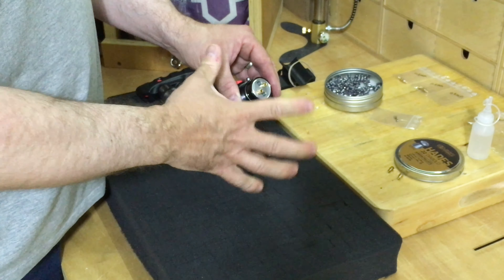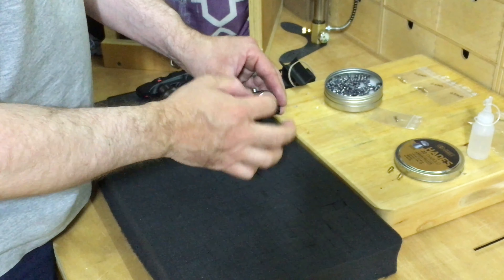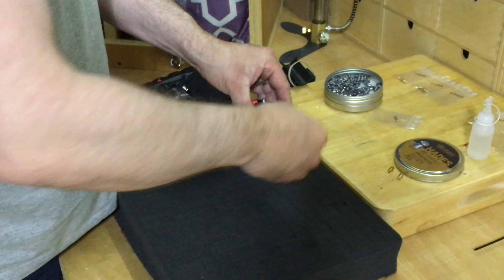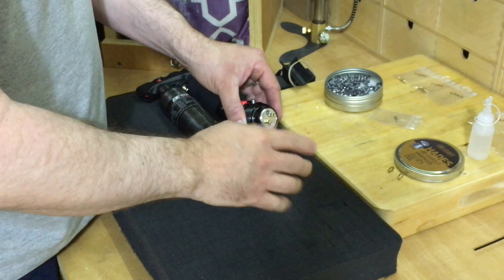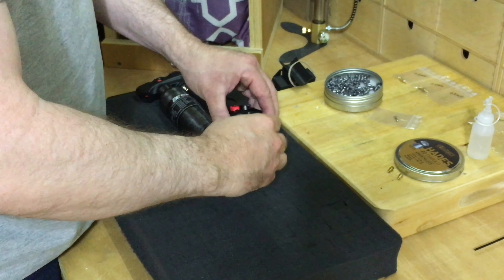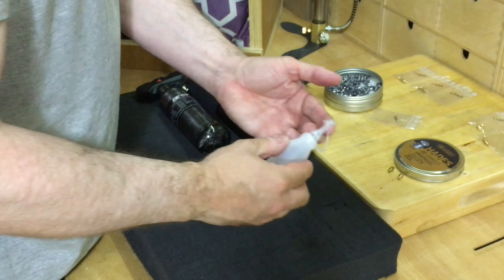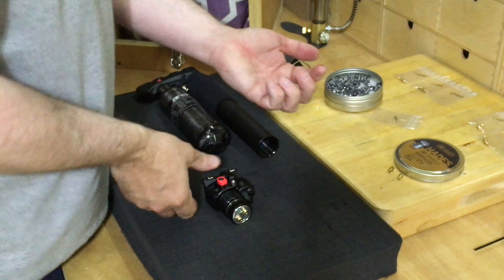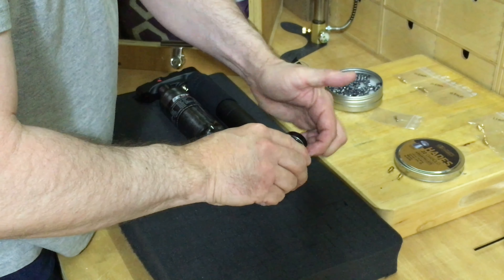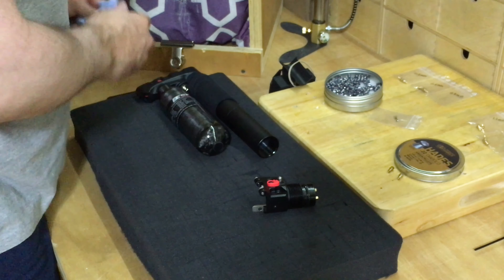Personally I don't want to overdo it and damage anything, so as long as they're as tight as they are, you're good to go. It's also worth noting that this whole metal piece does actually come out, but that's for another video. Like I do every time when I'm taking anything apart, the O-rings — you want them to last as long as you can, so it's always worth just putting a little bit of silicone lubricant on there to keep them good and prevent them from cracking.